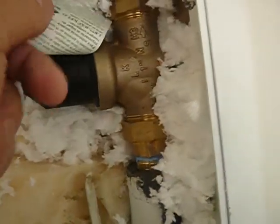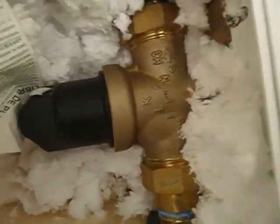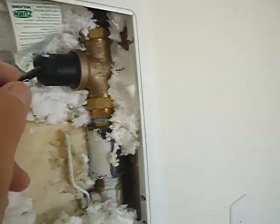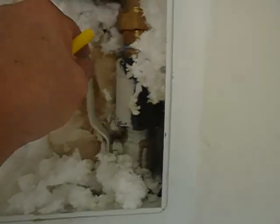All right, that's on. This is your backflow prevention device. It's also your pressure regulator. So if the pressure's a little too high, you can reduce that. If it's a little too low, you can open it up. That's how you do it. You got an emergency, you come through that door, you follow this wall, you open this door, you pull that handle.